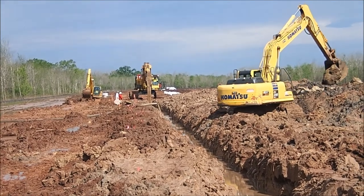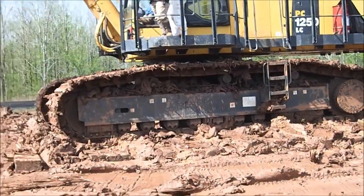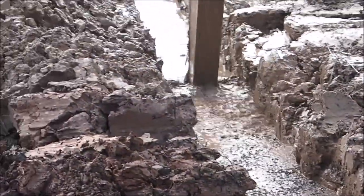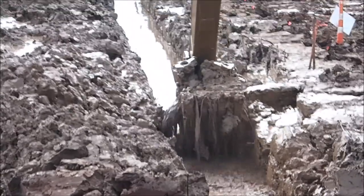Here's a job in Cachata, Louisiana, to dig a cutoff wall around a coal mine to limit their dewatering requirements. You can see the excavator just digs out underneath that slurry head, which keeps the trench open.